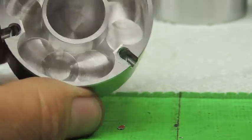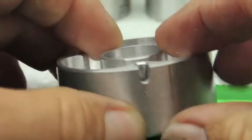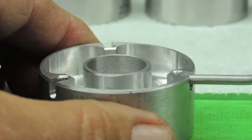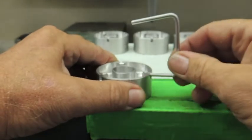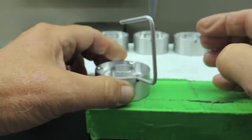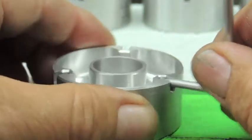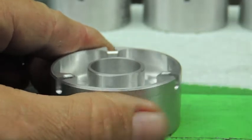All that work of drilling and reaming and slotting, all of that is so that when you put this leg in, move back a little bit, it can't do this. It can't swing around in either direction, and it's right in there solid. It can't move anywhere. And that's the difference between a minibull design stove and anybody else's in the world.